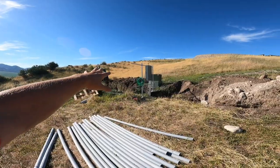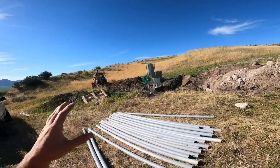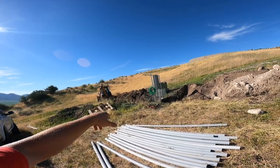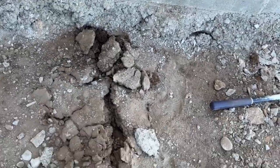The trench is 24 inches wide. Electrical and water can share the same plane at 12 inches apart, so they'll sit at the bottom of the trench. Then we backfill a little, put gas in — that'll be 24 inches from the electrical line, meeting code. I really wanted all utilities consolidated out here so I know exactly where they are. Since we're out in the middle of nowhere and had to do a transformer anyway, I wanted it all hidden back here — the dedicated utility section of the property.